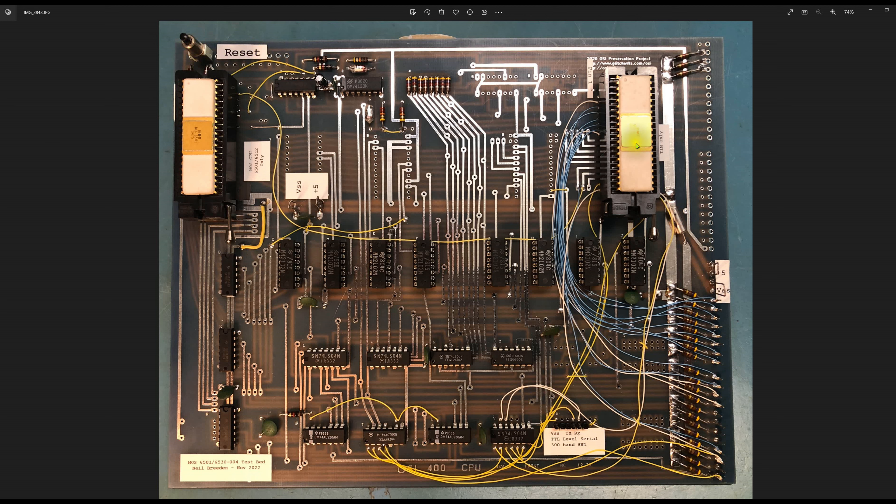Now let's shift over to the live demonstration of the TIM monitor. I've got several screens up here. This is a TeraTerm session configured for 300 baud, 8N1, connected to the OSI 400 CPU board. There's a command shell with a few assembly files in it — the folder structure is from compiling Apple 1 code; I just added a folder with a couple of assembly files we'll compile and send to the TIM. There's the Terminal Interface Manager documentation here, which is the original MOS documentation. And there's a Notepad session with the source code we'll compile and the process for loading it into the TIM.